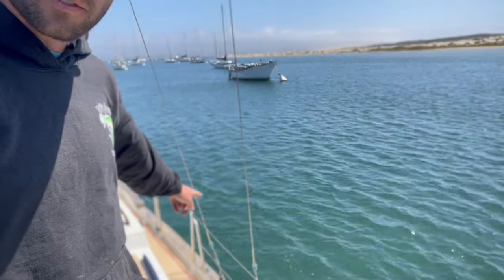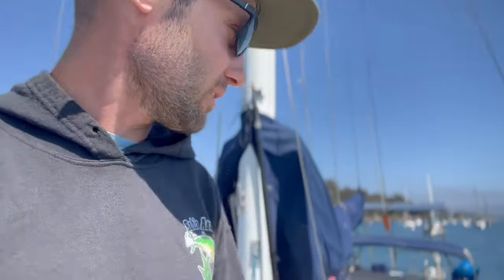Okay, well, as you can see, I took off the forward lowers, both sides. I had to take the pin rails off. Boat looks kind of bare without them. It's kind of interesting. So now I'm gonna ascend again, disconnect the forward lowers halfway up the mast. It's probably about 18 feet off of the cabin top here. Disconnect the forward lowers and reconnect the two synthetic shrouds that I made up. And then we'll see how far we can get today on the aft lowers.